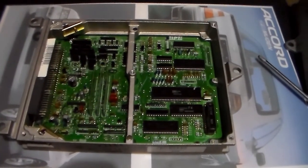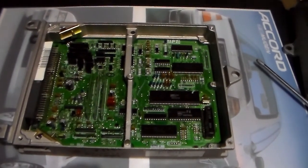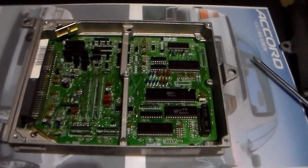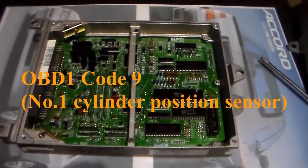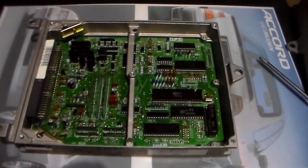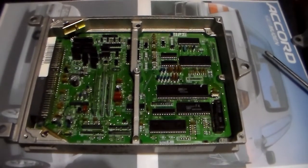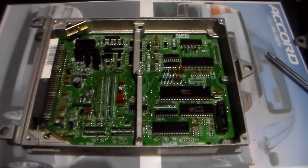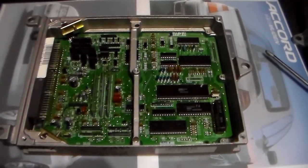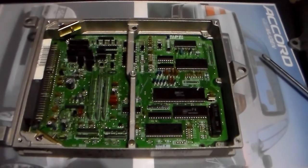There were no identifying signs of them being blown other than some corrosion, which I had to look really close to find. I wound up pulling them off and they were both totally blown. Those two capacitors being corroded and not working right was enough to create an intermittent situation where you would start the car and sometimes it would spit and sputter really hard, sending a number one cylinder sensor code on the check engine light — basically pointing at the distributor sensors as the fault. Sometimes it would run perfectly fine until about 10 minutes after running, then you'd turn it off, try to restart it, and it would give you a weird no-start, then spit and sputter and send that same check engine light code.